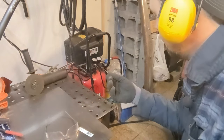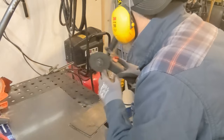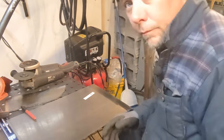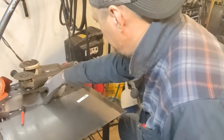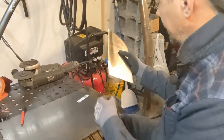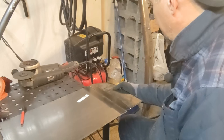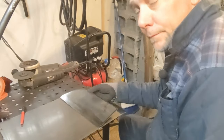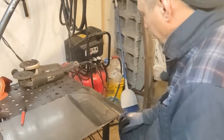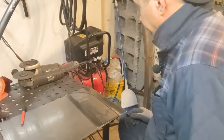There's a cautionary tale for you — I'll cut right through my welding table. I just came through here with a worn-out flap disc because they put so much oil on these and you can see it's kind of baked in. I wanted to create a nice surface to weld to. I'm going to go ahead and weld these two pieces together and then start massaging everything as we go. My lengths are fine — I've got a little extra to play with. My next step is getting these welded together and figuring it out from there.